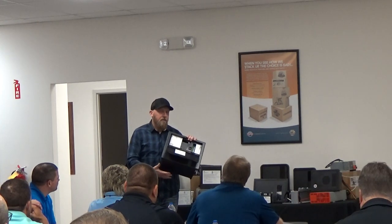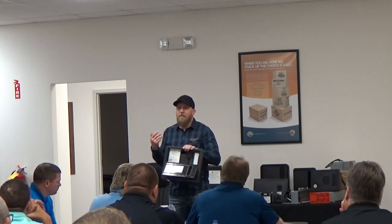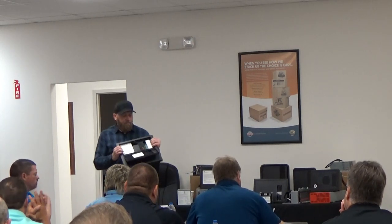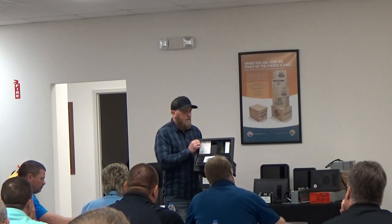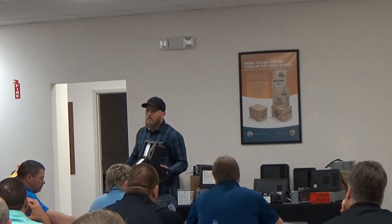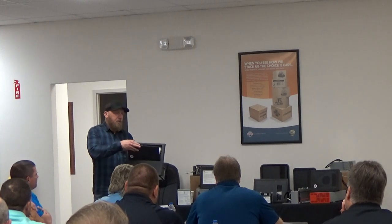One thing I didn't touch base on is our fans are 3-speed fans. So when the fan first comes on with a load, it's going to be at a low rotation. And then once you get more amperage on the system, it's going to speed up a little bit. And then once you get a little bit more, it's going to speed up to high. And it'll also dwindle down the same way until you get to the point where it just shuts off.